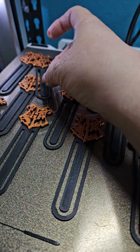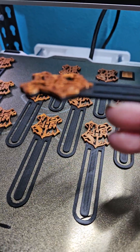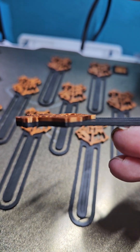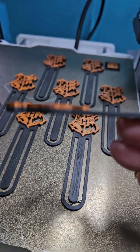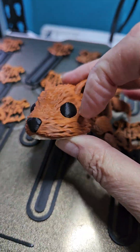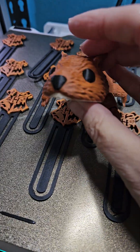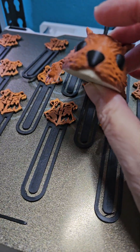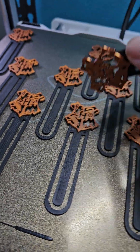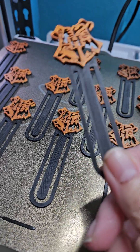This is my favorite way to do multi-color — honestly on any multi-color printer — is a layer print, meaning it starts out one color and then changes colors at a layer change, not within a layer. This type of multi-color where it changes from brown to black back to brown requires a lot more filament changes and therefore produces more waste. If you can design the part to be changing colors at a layer rather than within a layer, you're going to save a heck of a lot of filament waste.